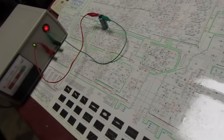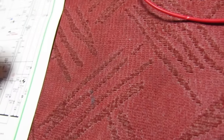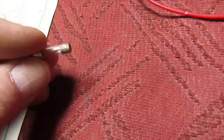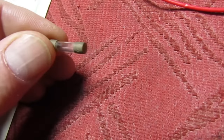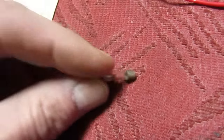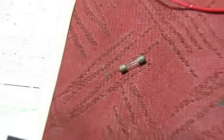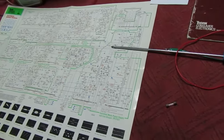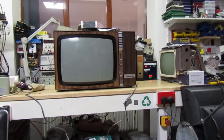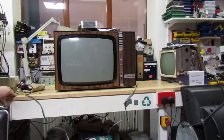I can't see anything that actually blew that fuse - probably just the charging of the cap during reforming. When you look in the fuse it's not violently blown; I can still see the element. It could just be an aging fuse that needed replacing. I'm going to try turning it on again. Camera's rolling, variac still at 80 percent. Here we go - three, two, one - on.